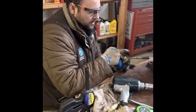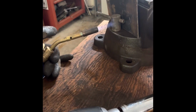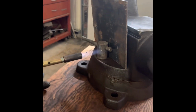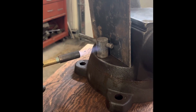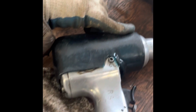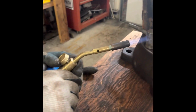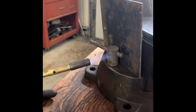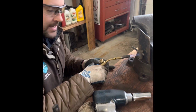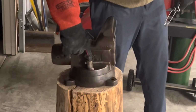You can see that on this component piece we are unable to get it to twist off the bolt on the inside so that I can release the ability for this vise to spin on its base. So we've tried welding up rebar and a ratchet, we've tried cutting a box end wrench, and now we are heating this with a small propane torch to see if we can get any movement. But so far it's just been 3 weeks of using PB Blaster and spraying and a few other things to get this to go. Get these components off.